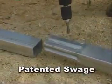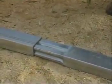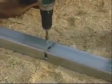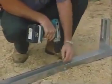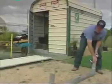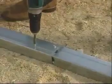This is our patented swage end, which fits perfectly into the tubing. Construction of the rail is simply a matter of pushing the pieces together and screwing the rail together with two tech screws at the joins. Before placing the screws, ensure that each swage end piece is perfectly in line so there are no kinks in the tube. You can do this by placing the rail on its side and checking that it's nice and straight. Then simply flip it back upright and screw it together. Follow this procedure to construct the other base rail.